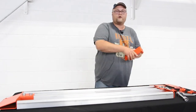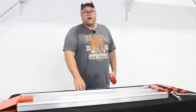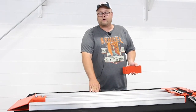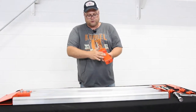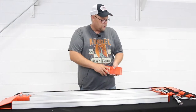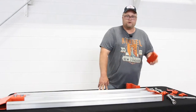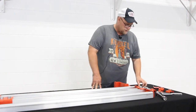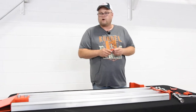Some of the hardware you'll get with the short panel — the panels will all be the same height, but you'll have different types of hardware. On the short panel, the one that goes over the short diameter of the spreader, you'll have some front clamps. These will be smaller and solid. On the large clamps for the larger diameter spreader, they'll have a hole — I'll show you that shortly. You'll have four of those for one panel, two steel spacers, some 2½ to 2¾-inch bolts, and some back clamps. We discussed the back clamps earlier — these are essential in the drop-ons as well.